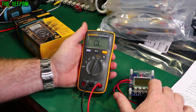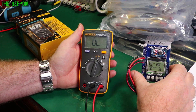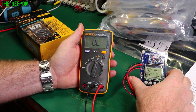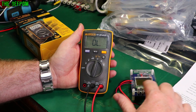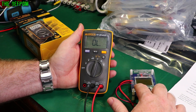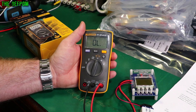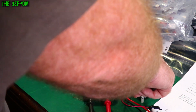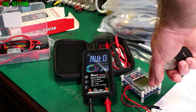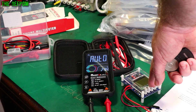It says about 50 to 60 milliseconds there — still not quite catching every pulse. 250 milliseconds is the slowest I can get on this, and it's got the same pattern so I think it is catching everyone now — about 200 milliseconds. It's not catching everyone — that gives you an idea how much slower this one is. Now I'm trying this Musttool MT-11 and I can't get it to beep at all. I'll wind it right down — I've got a 250 millisecond pulse time and still can't get the beep. I'll reduce the space ratio right down and see if that makes it work.